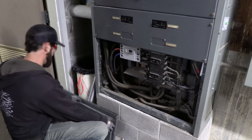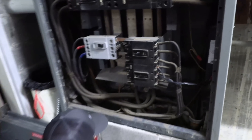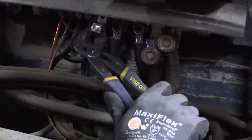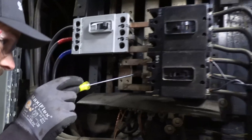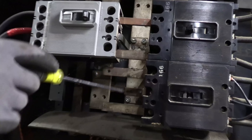We've got to make sure we get these covers back — they are unique; none of the faces were the same. That, my friends, is probably the best commercial three-phase surge suppressor you can buy. We're trying these lugs on for size — a 250 kcmil neutral which will be a white conductor — and it's going to fit right there in an existing hole. We've got a number six copper grounding conductor going right there. Take a look at these standoff kits — they secure to each phase. We were able to secure a breaker on eBay but couldn't get these copper braces or Z-brackets, hence the utilization of Article 240 10-foot tap rule.